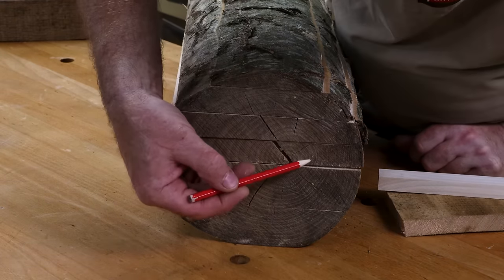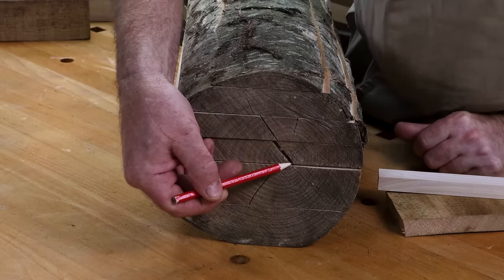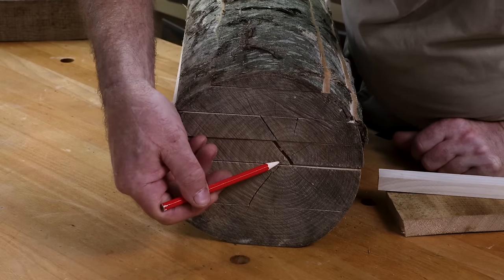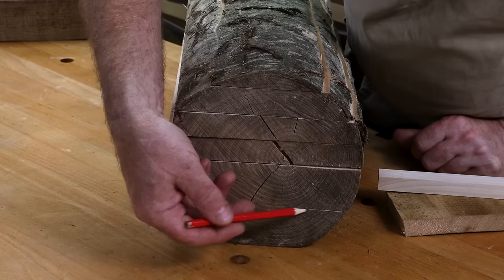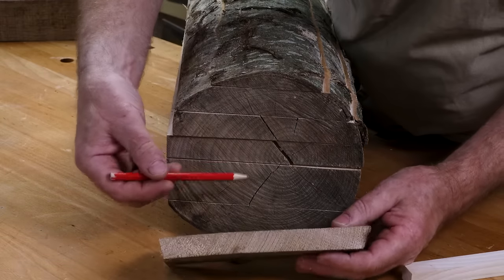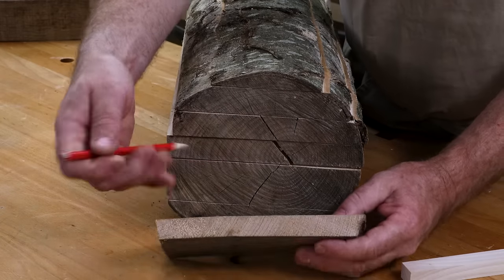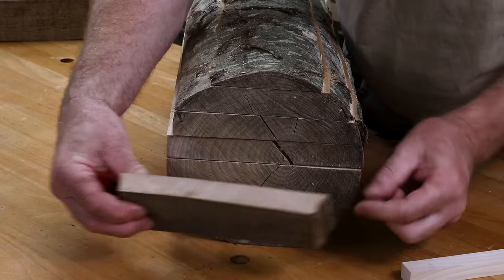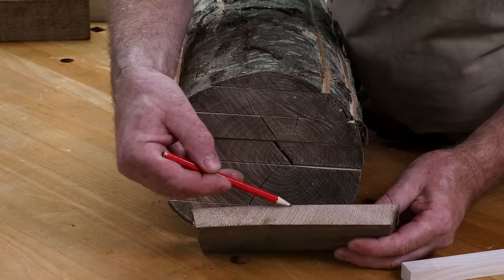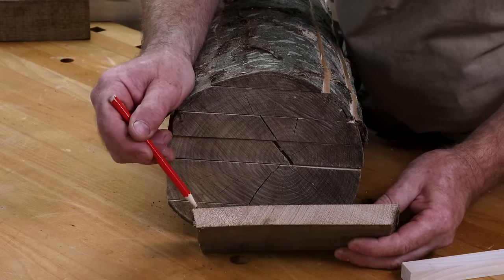The middle boards here, where the grain, and we can see the heart there, is at 90 degrees to the edge of the board or to the centre, is quarter sawn, they're more stable. As we come out towards the edge, the boards are going to shrink away from that centre point. So this board, if you take it, we've got the bark edge here. Our growth rings are coming round here. The centre of the board was actually over here.